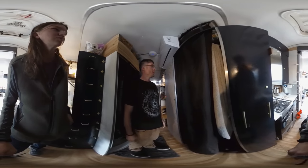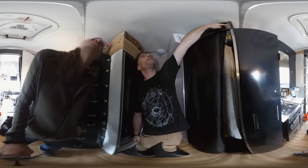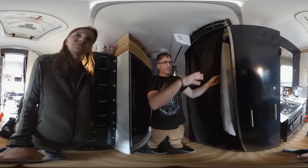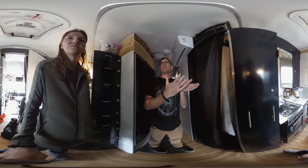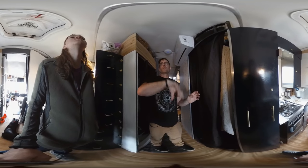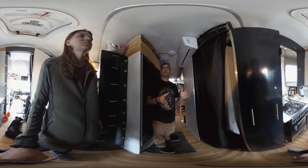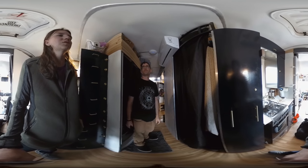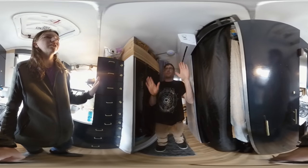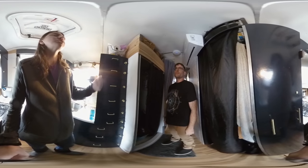Yep. On critical surfaces like this one here, you can see this is a piece of half-inch ply. It's not really attached up here, but further down it's attached securely to the frame and provides shear strength. The square tube is sort of a rectangular shape, but in many of the bulkheads, the plywood becomes a shear resistance for the square tubing. So it keeps it from going out of square, from moving. Right, if everything twists, it makes it more rigid.